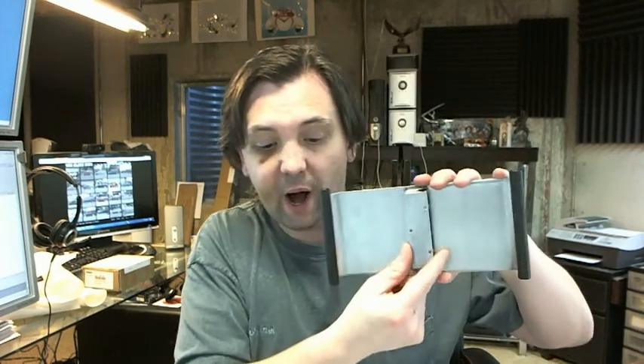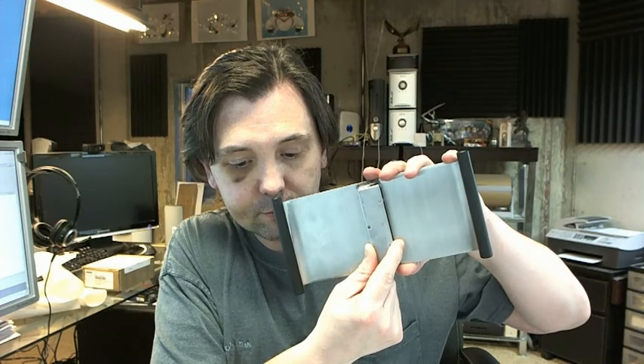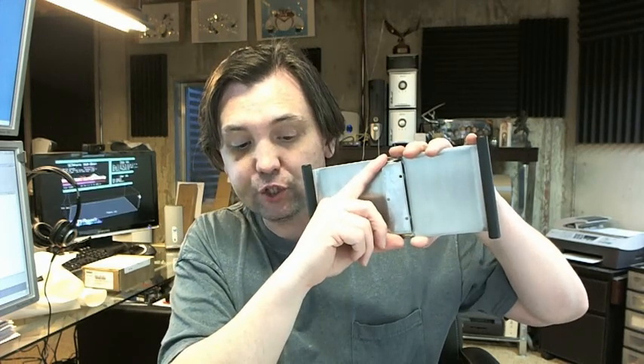You can see here in this drawing that you are going to accomplish a 4 inch high, 8 inch deep mortise to the edge of the door, all the way through. Then you are going to mortise a 1 inch wide, 4 inch tall preparation just for this welded-on plate.